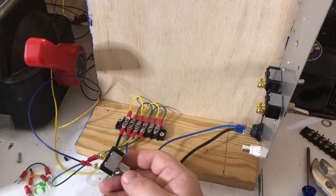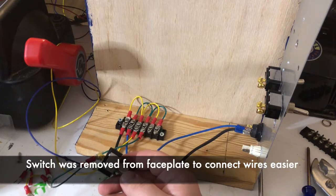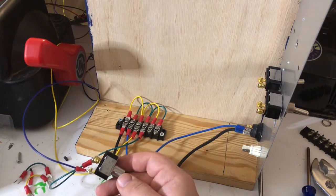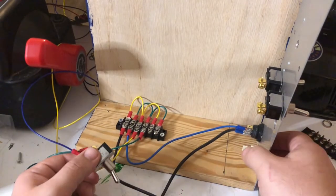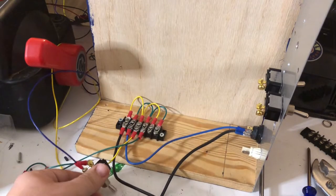All right, we're gonna do a test run, see if our lights are working. I never wire stuff while anything's hot, so you don't blow anything out. You never know, even though it is a hobby transformer, you don't want to blow up anything or short anything, get an arc burn. I know it sounds kind of crazy, but it's happened. So we're going to turn on our transformer. Then I'm going to turn on the master power switch. And then our switch. And yes, we do have lights.